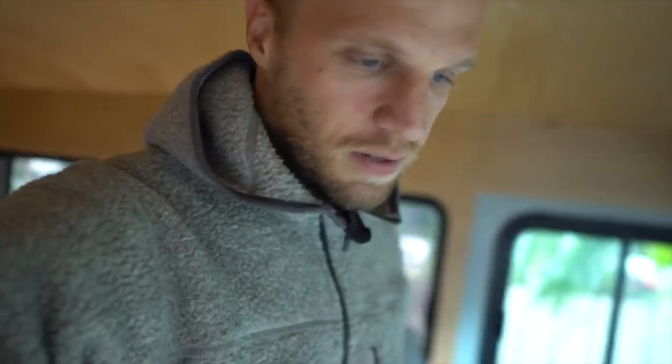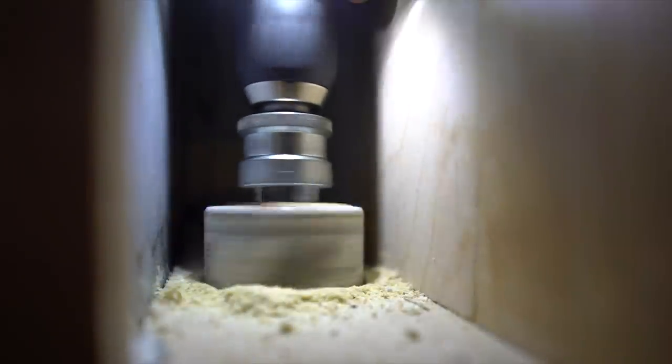Let's check on that potential hole location and make sure there's nothing crazy in the way. There is a second layer of insulation under some metal; I can see the chimney from under there. I'm pretty confident I'm in an okay location so I'm just going to start making a hole. I had a problem — the edge of my circle was the edge of the bus wall. I had to cut just to the left of it. That was a heck of a job, but I eventually got a hole in there. Our line set will be going up there. It looks pretty rough back here but we'll be filling it with foam and you'll never see it again. Now it's time to run the line set to where we're putting the mini split condenser.